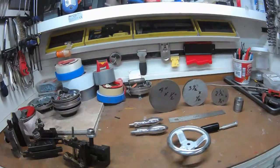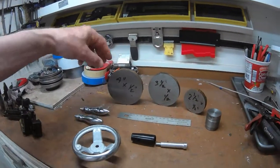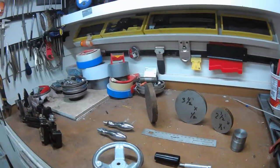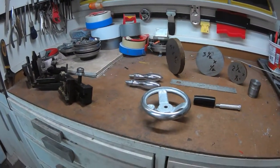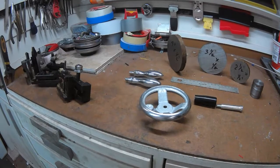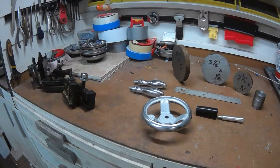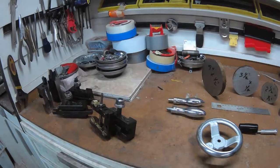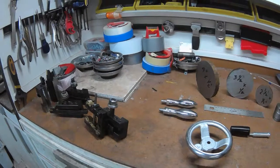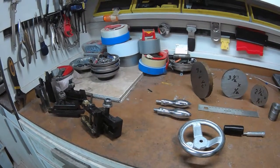For the wheels, I use different round stock from a metal supply yard — I simply have them cut it into a half-inch slice. At first I found cast iron wheels on eBay for about ten bucks, but the castings are kind of rough and sometimes not really concentric. I also found solid metal rotating handles on eBay, but decided to use brass and make my own.